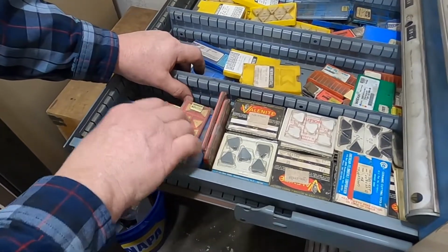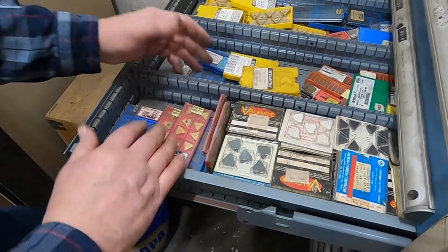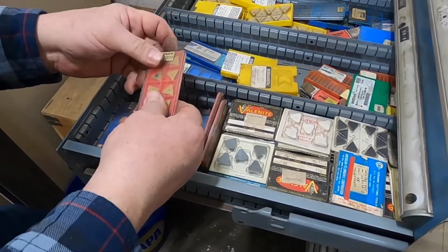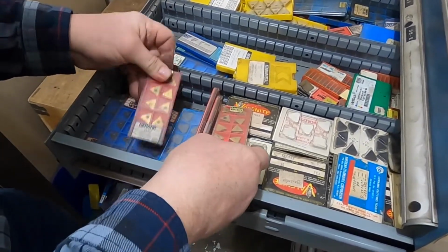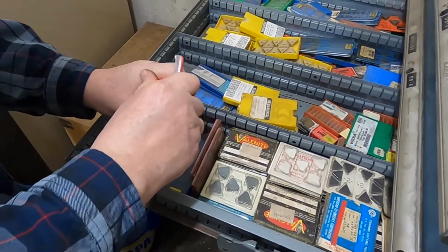Normally, you have to go back to a carbide to get more accuracy, because the carbide has a sharper corner. The absolute sharpness of your corner cannot be as sharp and hold together on a ceramic as it does with a carbide. Carbide will hold a sharper edge.